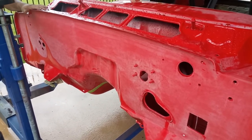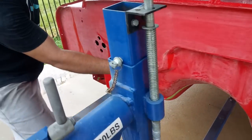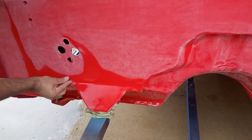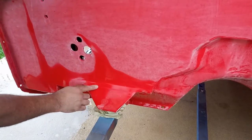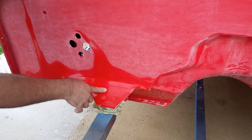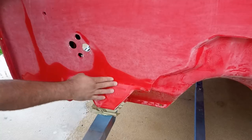This is a two-piece molded firewall. After I welded it in, there's a lip that goes down here. Originally, I cut off that lip and then I had to cut the body mounts to weld in on the inside, so it's flat. Then I welded in a plate and did all the body work — I wanted all of this to be molded. I didn't like the lip.